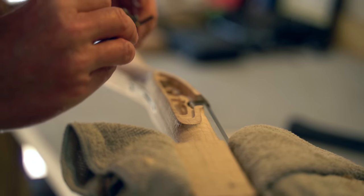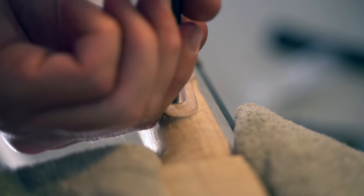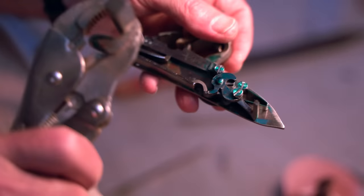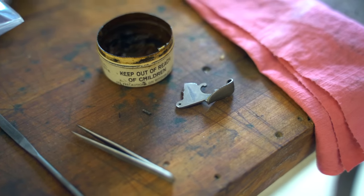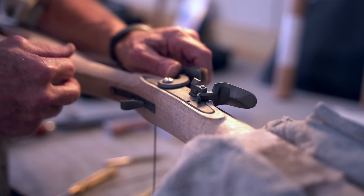Next it was time to inlet the lock — again a tedious process. Take it step by step: initially remove everything from the lock, mark it, put it in, see where the high points are, remove some material with chisels, and slowly work it down, adding pieces of the lock back until finally the entire lock was reassembled and fit in there correctly. Then it was time to add the trigger. It's cast, so remove material, get it cleaned up, and file it down to where it makes the appropriate amount of contact tension on the sear. We ended up removing too much material, so Joe helped me basically weld material back on, then we started the process again — less aggressively — removing material until we had just the right amount of sear contact so the trigger would work well without a bunch of slop.